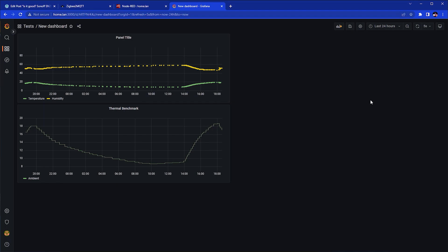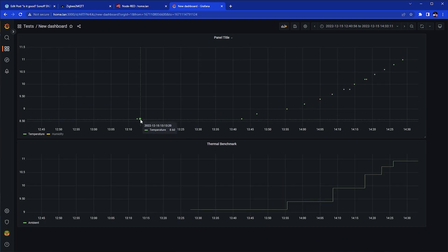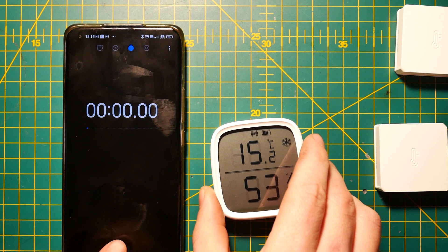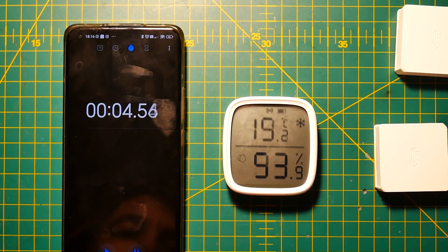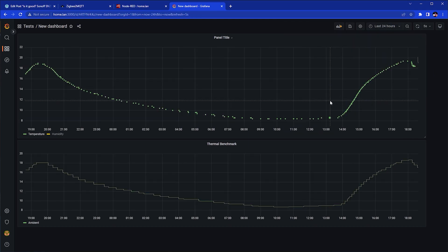I used my setup with Grafana and InfluxDB to chart all the temperatures over 24 hours to figure out the sensor's strengths. As you can see from the graph, the sensor reports back once every 15 to 20 minutes when the temperature is relatively stable. That frequency increases when the temperature changes more suddenly — I blew warm, moist air onto the sensor and it responded within 10 seconds, which is very responsive. After switching to heating mode, I discovered the sensor reports back every 0.2°C change. So if you're hoping for frequent data based on temperature changes, this is the right sensor. If temperature doesn't change, you don't need frequent responses — you'll benefit from longer battery life instead.